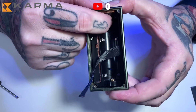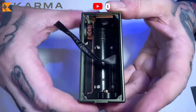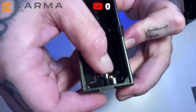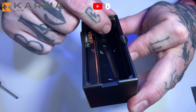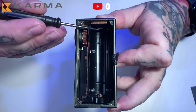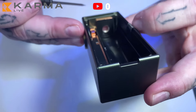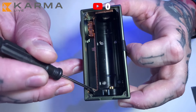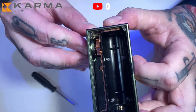Inside, the polarity is indicated — positive toward the atomizer's positive pin as it should be. In case of a short it fires instead of actually shorting. There is a plastic housing internally with a floating pin where that small spring goes. The top is insulated because the positive pole could potentially touch there, but won't once an atomizer is installed. On one side there is a thick solid copper plate — easily 1.5 to 2mm thick — and another that runs down and connects to the pin. The button is a large copper piece that when pressed obviously closes both sides.